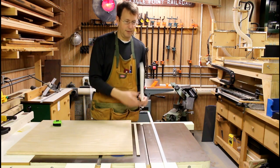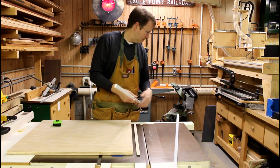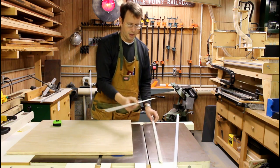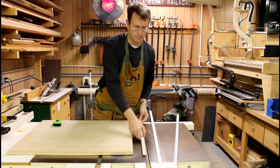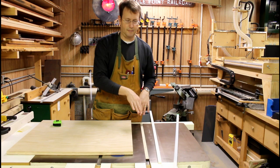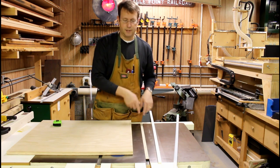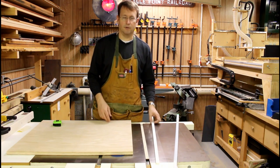And since this one's already been eaten up a bit in the past, I'll probably end up returning this one and going with this one. I'm going to pre-drill some holes into it, so I have countersunk screws, and I'll put some dimes in here to hold it up, put some glue on, then set the board on top, wait for that to glue up. Hopefully I can do that with super glue, screw those in, and then try the same for the other with double-sided tape, for lack of knowing what else I can use.